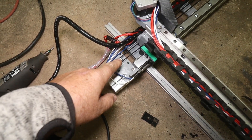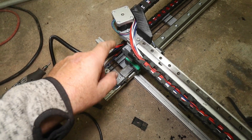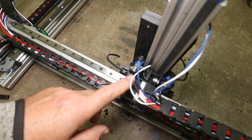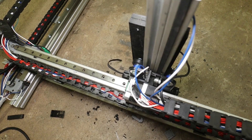All axes are driven like this - a belt and a small pulley. The Y-axis, and also the X-axis, and even that one. I think that is fine. It isn't really big forces here. It is more like the mass forces of the thing - acceleration and all that.